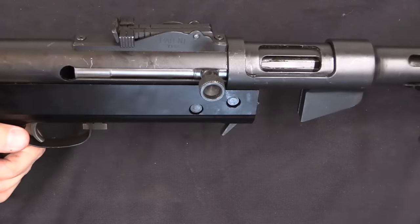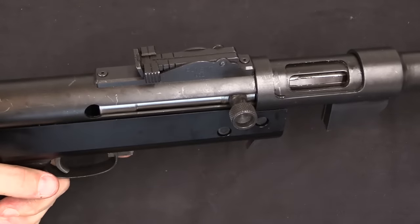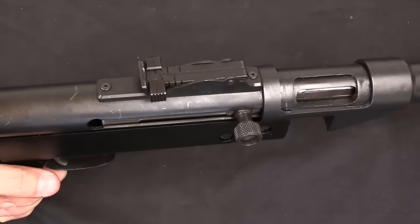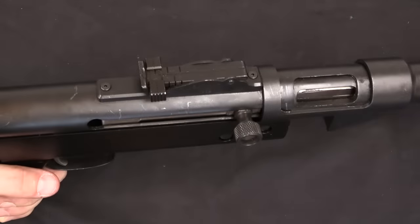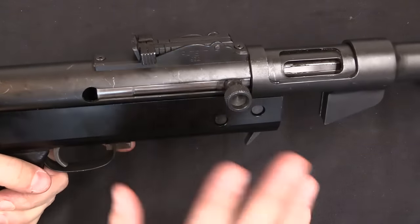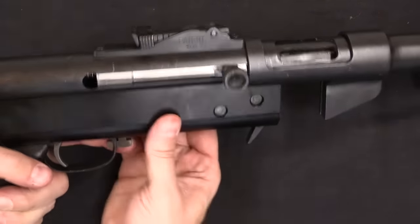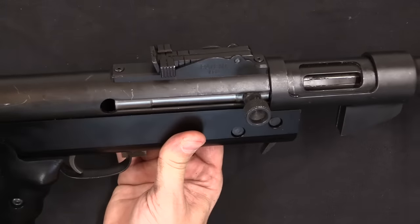What I find really interesting about this is that all of the design decisions have been made on the basis of what will make these guns durable so that we don't damage the receivers. Things like the added internal trunnion — in a worst-case scenario, if you have a cartridge detonate out of battery, you have tremendous metal thickness, and the thing that would be damaged is the trunnion itself, which is repairable and not a regulated item. We also have design decisions made on the basis of what's going to be most enjoyable to shoot rather than what's simplest to manufacture. There are far simpler ways to make this than the whole housing and Suomi drum setup, but it's those drums that are fun and make the gun a viable commercial proposition.